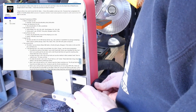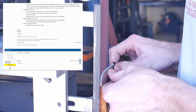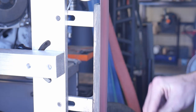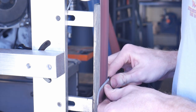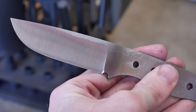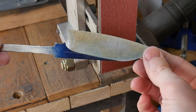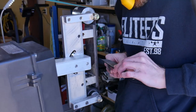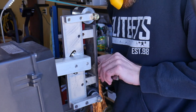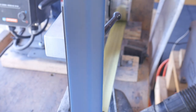Like many aspects of grinding, belt progression is also fairly individualized — everyone has their preferences. I went through historical postings and blade forums and compiled a long list of belt progressions, and I will put the link to that thread below. The progression I'll show here targets a decent machine finish, and I utilize this for knives that I plan to stonewash. I start off with a low-grit worn ceramic belt to knock down the edge, then move on to a newer low-grit ceramic belt. Once I get that bevel line close to the spine, I'll move on to a 120-grit J-flex belt and start refining my plunge lines. It is at the 120-grit stage that I move the belt off the side of the platen to start getting a radius in my plunge lines.